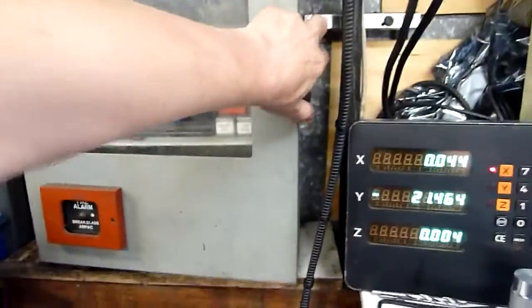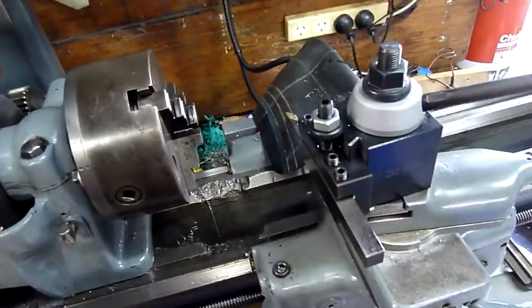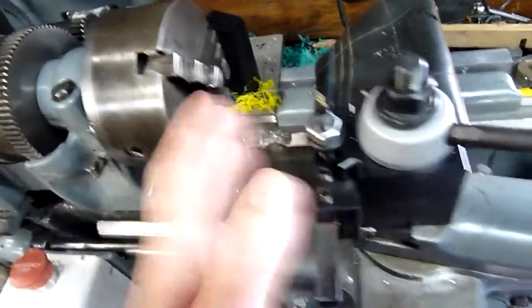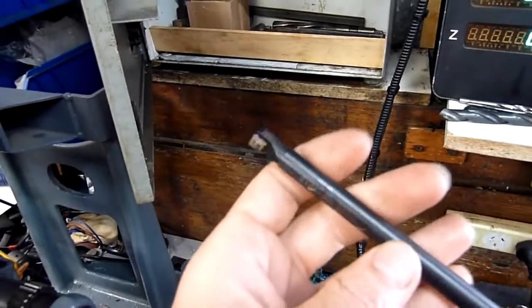There's a whole box full of gears in here. I've got all the back gears, the face plate for turning between centres, the original tool posts — lantern style and the standard square type. This is a new addition: a brand new Chinese all-steel quick-change post, much better than any old-style screw-type posts. There are two more in there and two brand-new ones in the box. New boring bars, internal and external threading tools — it's all China stuff, but for light duty hobby use I've got no issue with them; they work just fine.